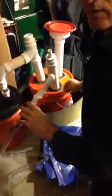We also, bear in mind, don't glue the gas holder on, again for the same reason, in case there's a jam for some reason. If you're starting with horse manure or cow manure and some of the fibrous material gets up and clogs it, you can remove it. And it is gas tight. This PVC is watertight and gas tight when it's just compression fitted like that. So this is a great home experiment.